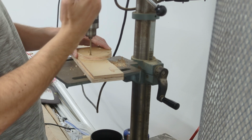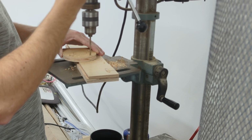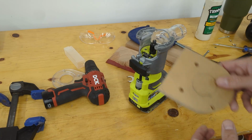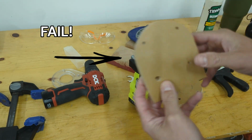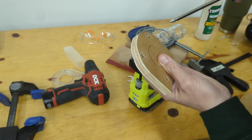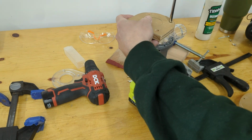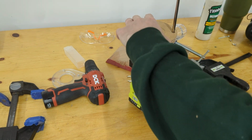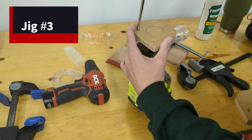Makes sense, right? I get started laying out the base plate with this 1/2 inch MDO plywood scrap. I'm using a brad point drill bit for the large hole, then a regular drill bit for the center so it's countersunk. I didn't put a depth stop on my first cuts, and I didn't go quite deep enough with the brad point bit. I tried to fix this quick with the drill, and the bit grabbed and pulled all the way through. Trash. So I grabbed some more scrap to start over.